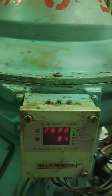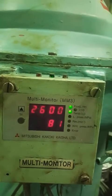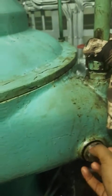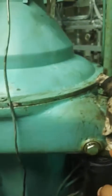Now you can see the flow rate is given as 2600 liters per hour, and temperature and wet pressure. Now we will check from this sludge port to see whether the sludge is out or not. Please be careful while opening this sludge port — open it only after the desludging has taken place, after one to two minutes.